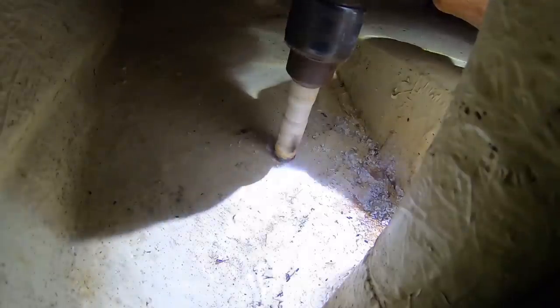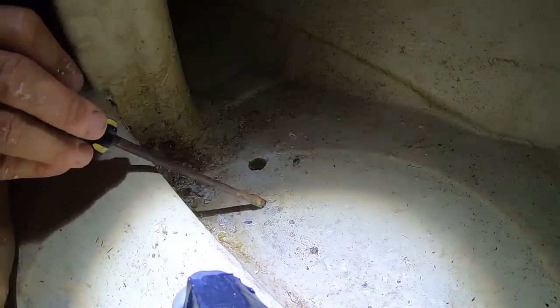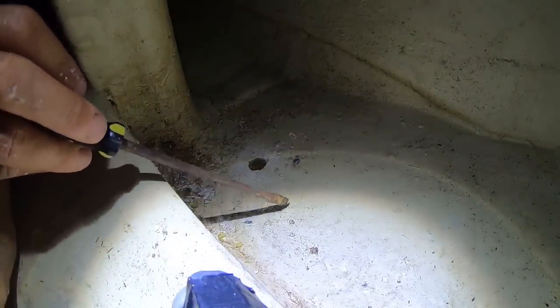The outside of the hull was good, so I ripped up all the floorboards — that was a mission — got to about 80% of the hull and tapped out the inside too, and it was sweet as well. So there's no real problem with delamination. However, we do have water in the hull at the back — we knew that from before, and you can see it from the leaking shown in this video. You can see the salt mark, the crystal trail — there's a little tiny defect in that skin.